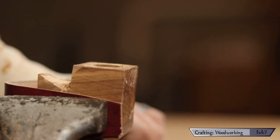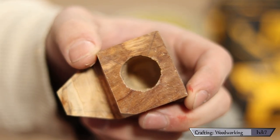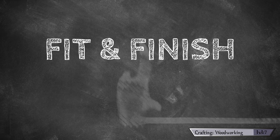Keep checking every once in a while to make sure you can see the little hole that you made — once you can just see it, you're done, stop. It's hard to make out in this footage, but there it is, and as you can see air can pass freely through all holes. This is another portion where having a drill press would be awesome, because coming down exactly center is a little tricky by hand.